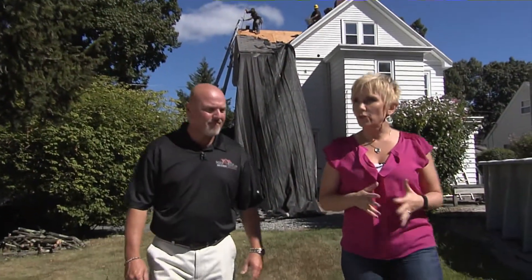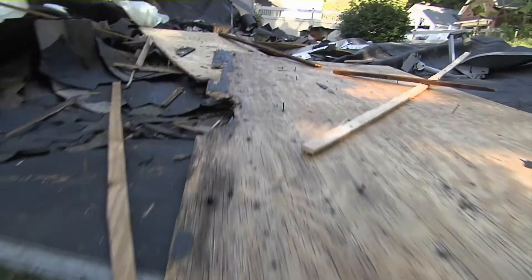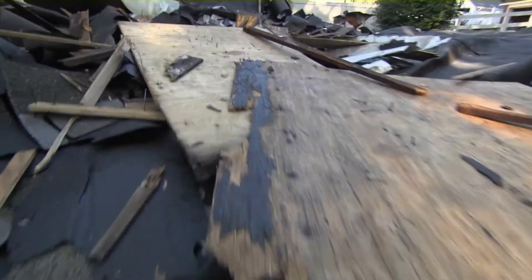And the rest of the inspection occurs outdoors, correct? That's right. All right, let's go check it out. So now that we're outdoors, what are you looking for inspection-wise? I'm looking for visual signs of a possible problem with the roof — rippling shingles, corners of the shingles that may be turned up. Those are indications of a moisture problem.